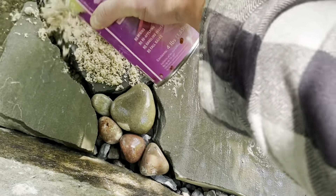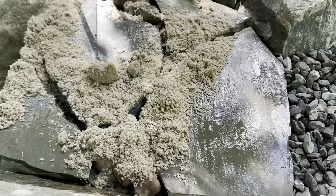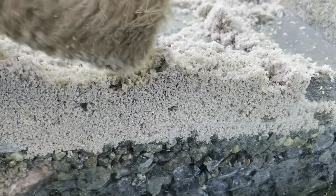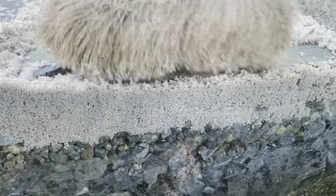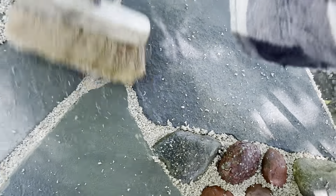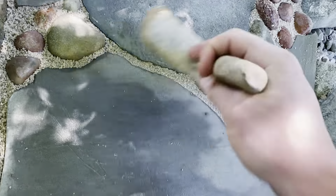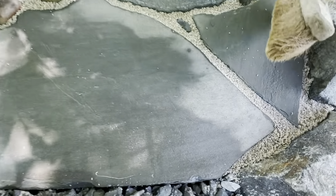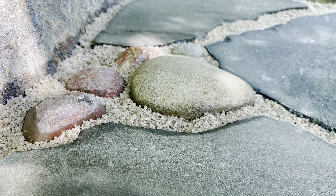Here's a small can of the same product I just used — Rompox Easy. You just pour it out and sweep it in place. You don't want to compact it too much; the more you compact and tool it off, the less permeable it becomes. It'll still be permeable, but it fills in those gaps a bit more. Even without tooling, just sweeping it off, the joint hardens up really, really nicely — it gets super solid. Plus this nice sandy color just looks really good.